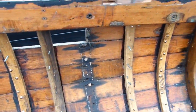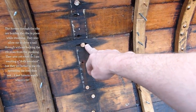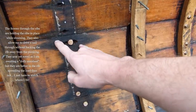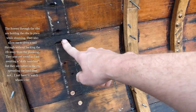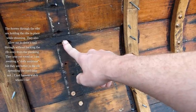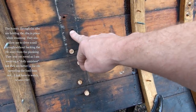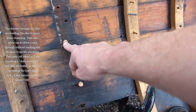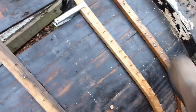Jumping back inside the boat, you can have a look at some of these repairs. These are actually okay — this one here obviously looks pretty nasty, but the damage is actually fairly limited to the surface; it looks a lot worse than it actually is. So I'm going to cut a graving piece over the top of this one to remove the worst of the damage. The plugging from the outside is to retain the strength in the nail fastening — we'll plane that smooth and then fit the graving piece over the top. The rest of these nail holes I'll just drill out to clean up any rust remaining, but they are largely okay.